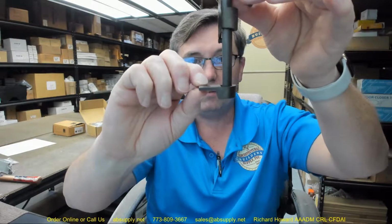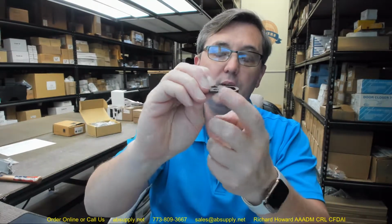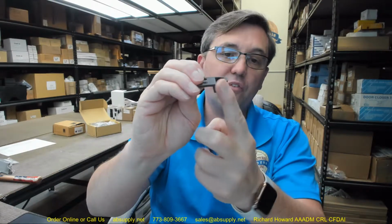They also have a rim strike. That rim strike is going to work the same way that I just described, where you will mortise it. And this is the common Dutch door strike. Okay, this is the common style. Same application, pull side mount. You're going to mortise this portion onto the top of the door or into its shelf, and this portion will hang off. I would opt to use this. It's a closed-off, enclosed strike application with less projecting sharp hardware. Not that this is sharp, but less projecting hardware with blunt ends.